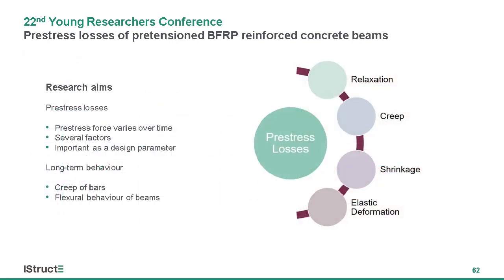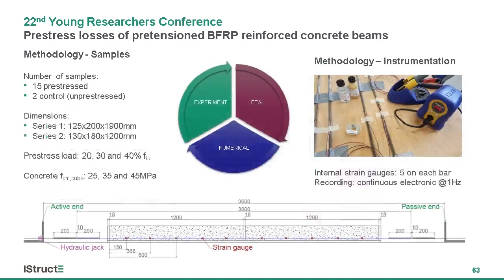However, while there is significant research to support the idea of mild pre-stressing, the area is under-investigated in the aspect of long-term behavior and especially pre-stress losses. This is an important design parameter influenced by various factors such as shrinkage of concrete, elastic shortening, and relaxation of tendons. It is therefore the main aim of this research project to clarify the causes and quantify factors affecting losses of pre-stress of BFRP pre-tensioned beams and their effect on the flexural behavior.